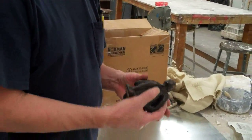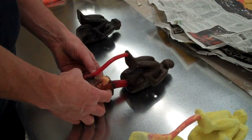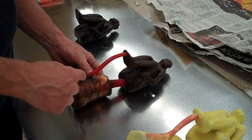In the beginning, you start out with a wax form of some type. Once you have that object, the next stage is making it so you can actually cast it in bronze. So you add the gating, a cup, and this one is called a vent.